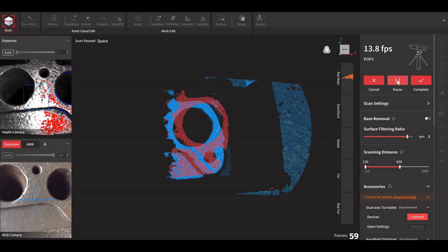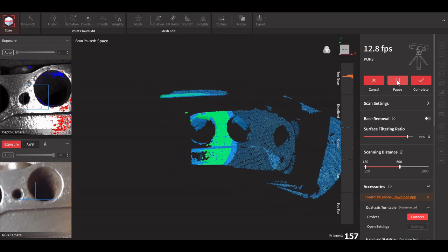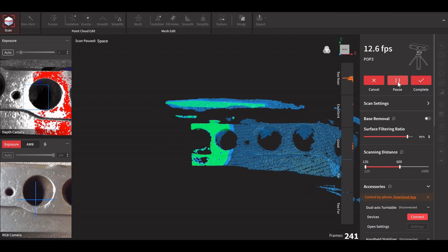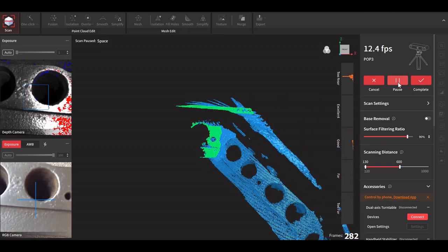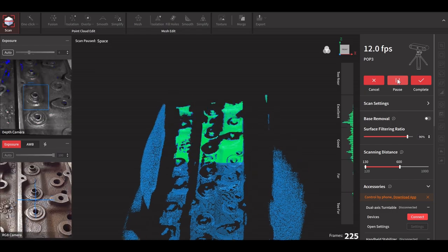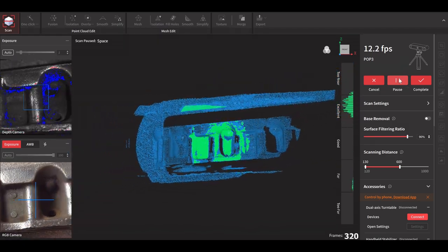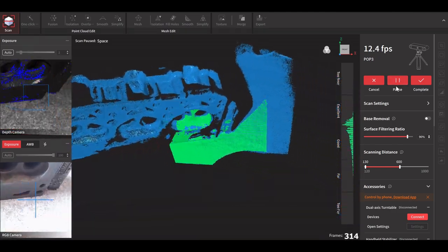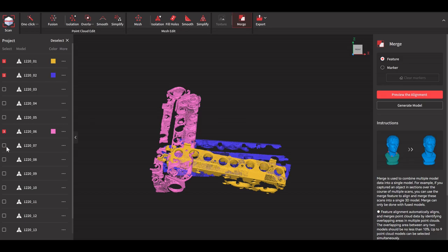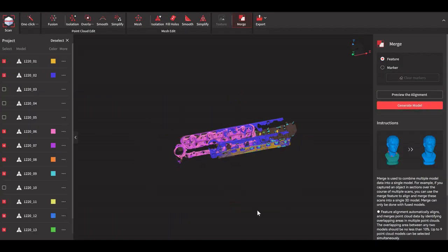Freehand can be tricky because you're trying not to get too close to the cylinder head but also keep the speed up and not overwrite data you've already captured. I'm still trying to figure this out — it's a lot easier using a turntable, but the head is just too heavy. I messed up one section, but fortunately there is an undo function. So I carried on scanning the head: do a bit, move it, do another scan, and it seemed to go pretty well — started to build some confidence. When it's all done you end up with point cloud data scans of the head.